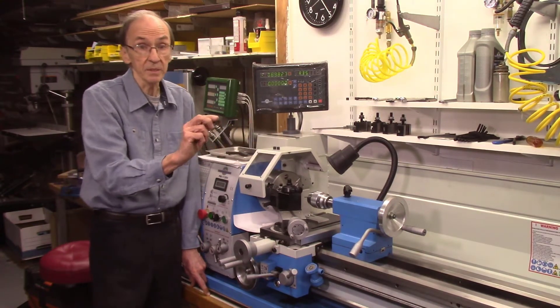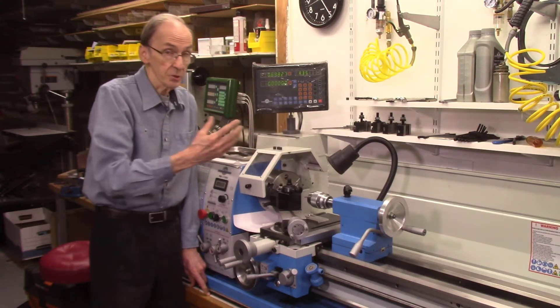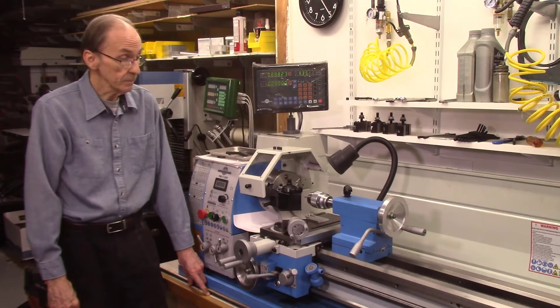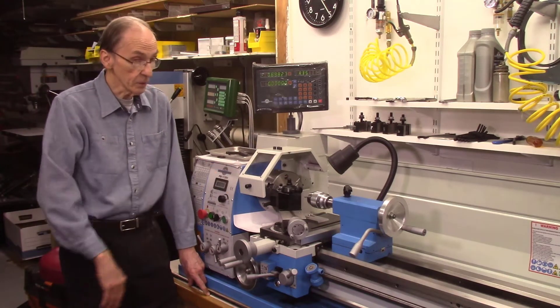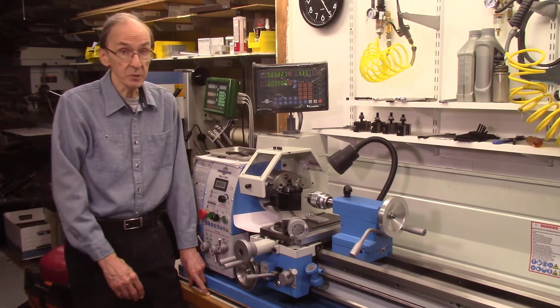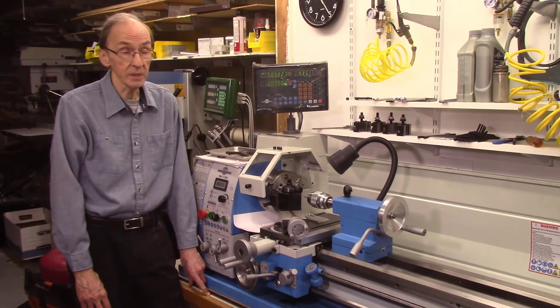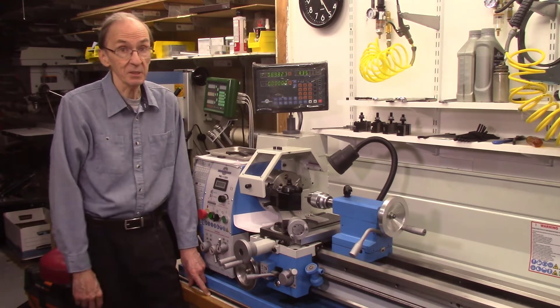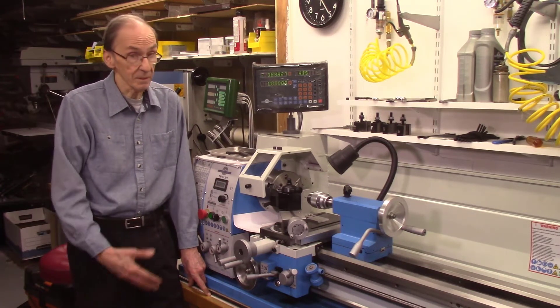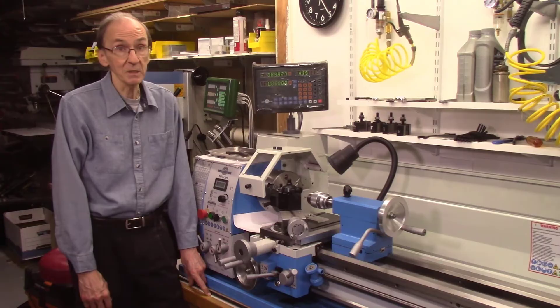In the past when I farmed these out, they cost about a dollar and a quarter a piece to have them machined. There's only about ten cents of material in this part — the rest of that is all labor. To do it on my lathe may be slower than using a different machine. Usually when it's done in a factory they use what's called a screw machine, which can spit these things out in seconds. It's going to take me about a minute a piece to machine these, but my labor is less expensive than farming it out.